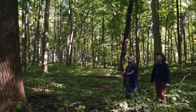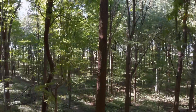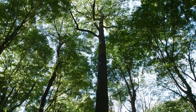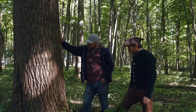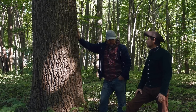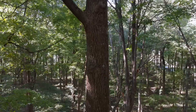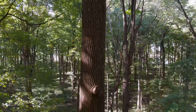This tulip here looks just about perfect — a really nice straight, untwisted, long trunk. How tall do you think this is before that first real branch? I'd say that's 60 feet. So what kind of diameter are we looking for? A minimum of 25 to 26 inches, and that's a narrow canoe. There are accounts of canoes so wide you could put an easy chair in the middle. 30 inches is a great width, and there are accounts of very long canoes — up to 40 and 60 feet — with many people riding.